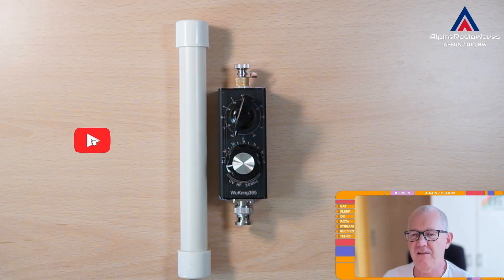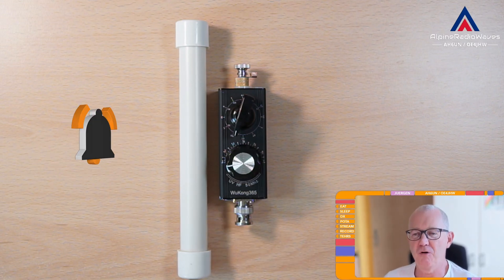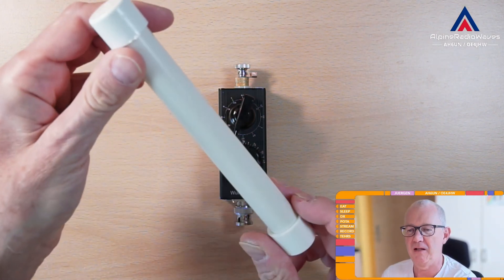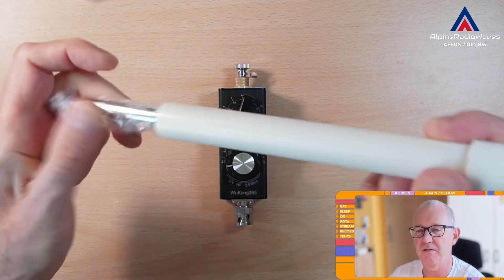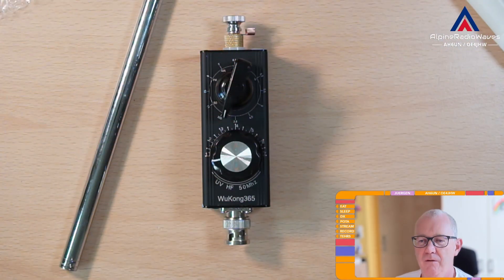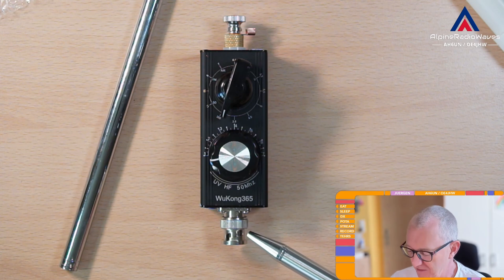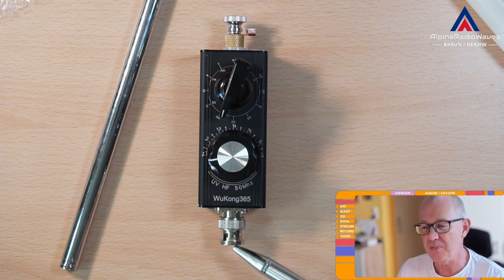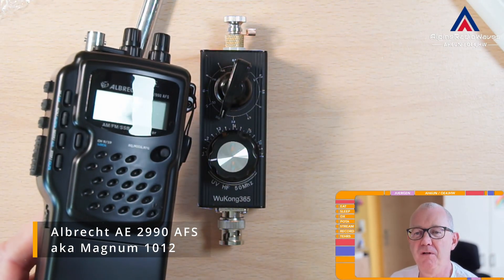More precisely, it's an antenna tuner and it comes with a telescopic whip. The whip is in this plastic tube here. Let me open it up and get it out. You can buy these tuners with a BNC connector and also a UHF connector. Mine has a BNC connector because I want to use it with this radio.